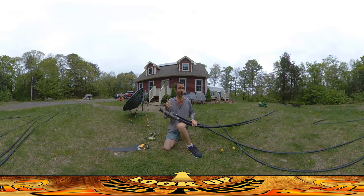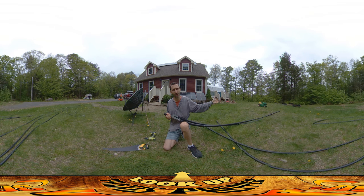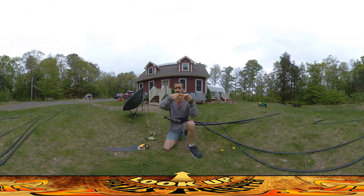I've already got the pastures and the foundation all ready. I'm going to follow what's called the daylight drain — there's a perimeter drain pipe being put around the house, actually tomorrow. There's a pipe that runs out so if you ever get a lot of moisture around the foundation, it will run out through this drain pipe to daylight and drain away. I was thinking about following that course with this pipe.